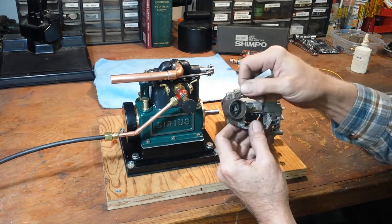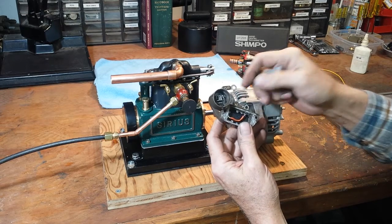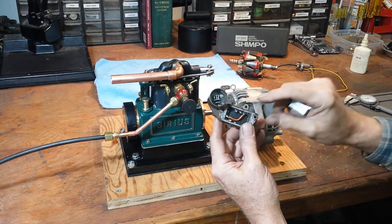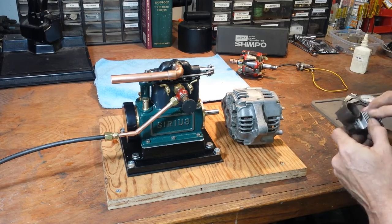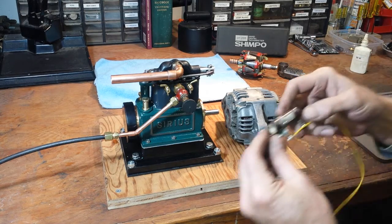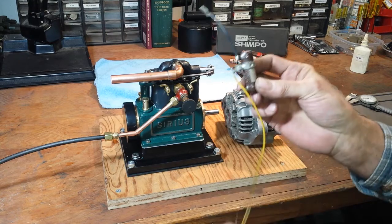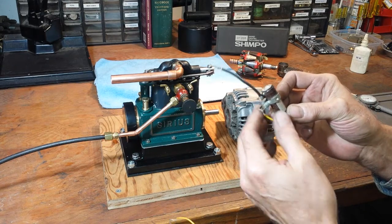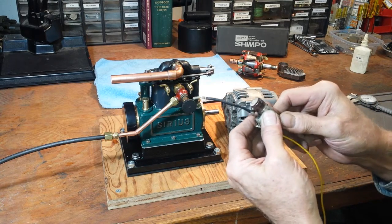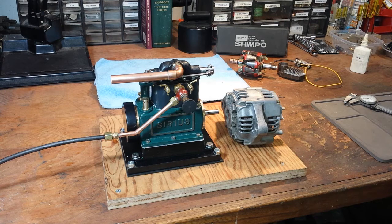He showed me how this terminal is connected to the positive side of the system, and how I could remove the alternator bridge between these two terminals, which takes one of these pins in here to ground, which can then be adjusted. I found in my drawer a 25-watt, 20-ohm wire-wound resistor, and as a lash-up I grounded one end, connected the other to the voltage regulator body, and just adjusted the slider to adjust the current — which wasn't real handy. But I've got a 25-ohm, 25-watt rheostat coming.